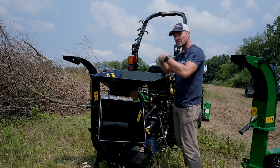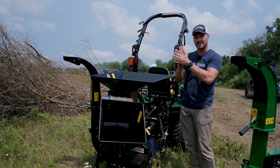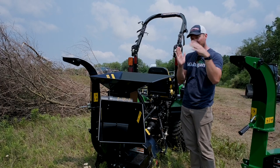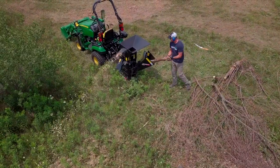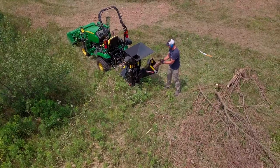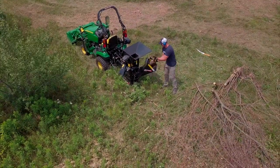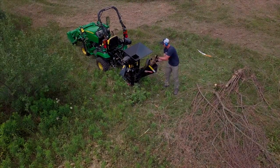It's just going to keep pushing it through, whereas a chipper is a plate or a disc, just kind of gnawing away at it as you're feeding it through on end. So there's not much room for that material to get stacked up without clogging. With the shredder, it's just a big open chute that feeds all the way down, and these knives are kind of driving things along through the chute instead of at a perpendicular angle.